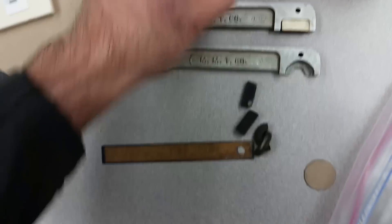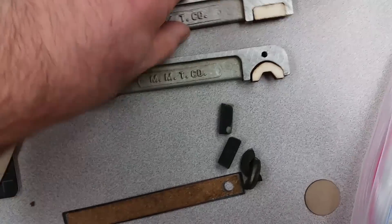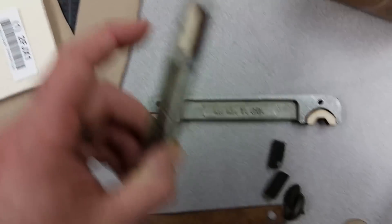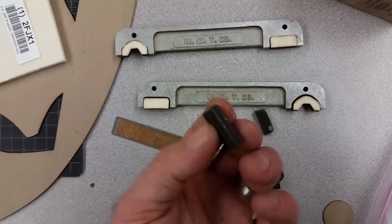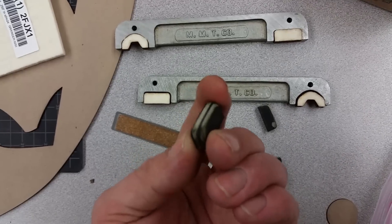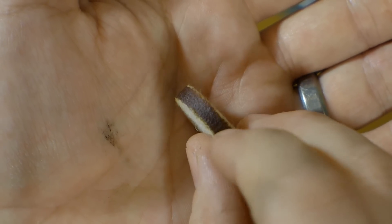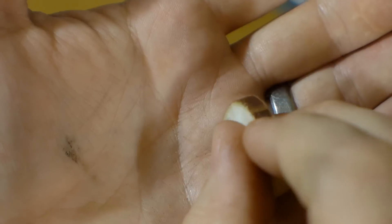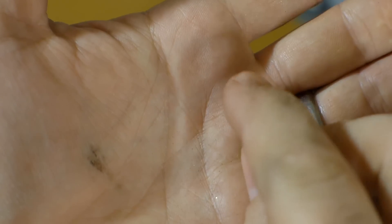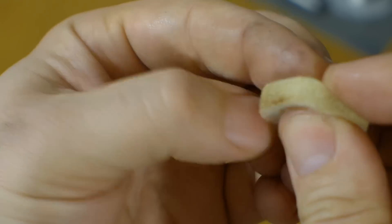Here's our parts — a pretty good fit. Thickness seems to be right, a little bit hanging down, compressing there. Here's the original pieces — this is the original Monarch multi-layer rubber felt material. You can see the edge of it — it's essentially burned hair. It kind of sticks together and it's cauterized looking. But all you have to do is take your finger, rough it up a little bit, and it just crumbles right off. You can't even feel the texture; it's just a stain. So it eventually cleans up and essentially it's just felt that's a little bit brown. I can live with that — it's pretty tough stuff. It's flexible. This is F5 felt and it is commonly used for way wipers.